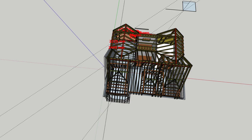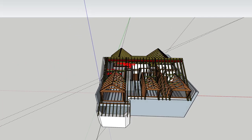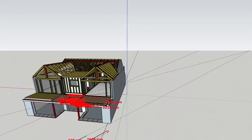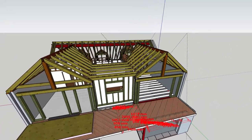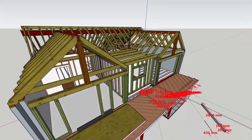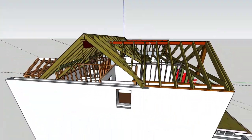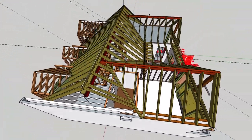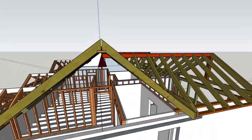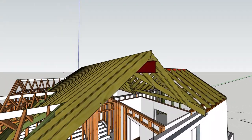This was a double-story wraparound extension. We took off the roof, completely rebuilt it, added these dormers and the rear section at the back and this flat section. So all of this was drawn to scale, again, for all the reasons that we use 3D. We had steels in the roof. This was done in 2018, so it's a bit less common to have steels in the roof to set all of this out. Now it's quite commonplace, so I needed to check my heights.